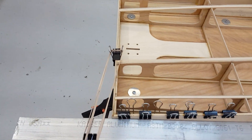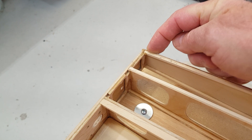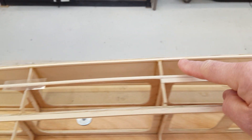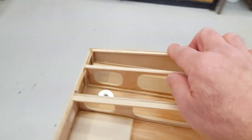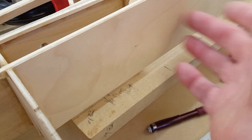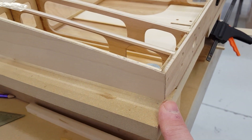When you're going to mount it on the boat - we've got our 1/8 inch glued onto the lower - the only things that matter are where this notch is positioned. The lower notch here is positioned on the transom. Up here, this needs to be exactly the same distance as the lower. I wind up poking the 1/8 inch piece through a hole here which I've made at exactly the same distance and height from the jig as the notch in the transom back here.